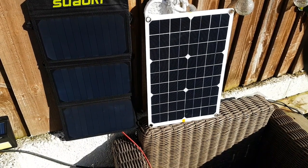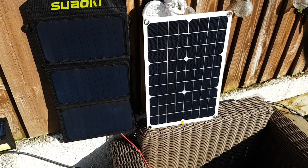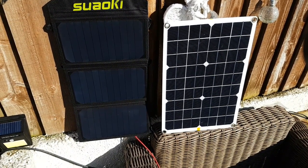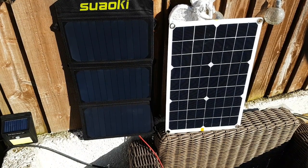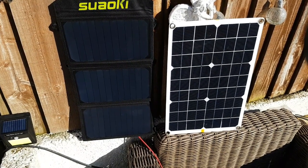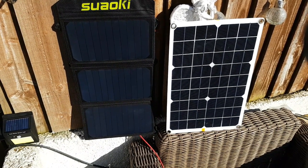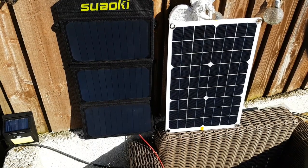When it came I could see it wasn't right — what they meant was 50 watts at 12 volts, but all the maths was wrong. So the folding solar panel seems to be much better. Trying to charge the radio directly is basically not enough power, though there may be just enough on the foldable one. I suggest charging up a battery pack and then when you're ready, use the battery to charge the radio — like a proper solar system. Charge the USB battery pack up; that's the best way, and then use the battery to charge the radio and your phone.